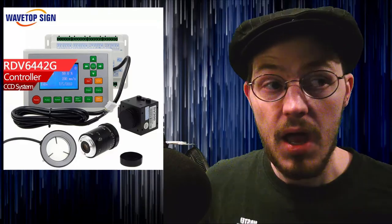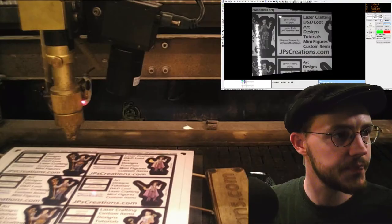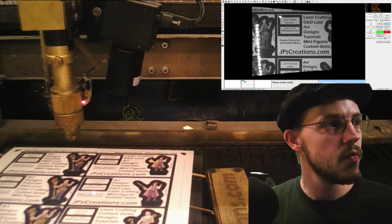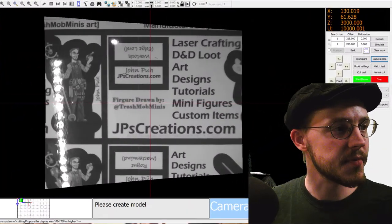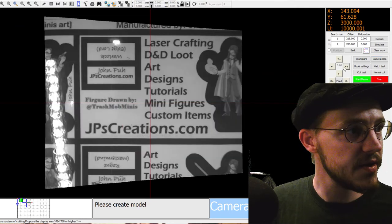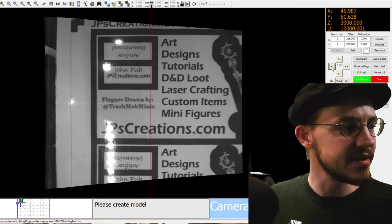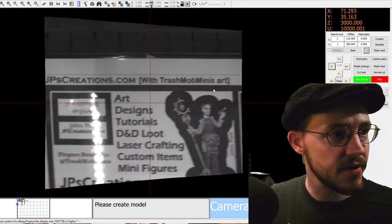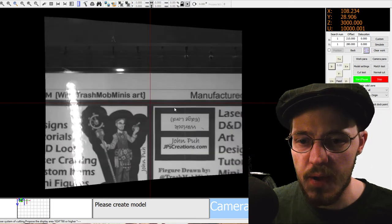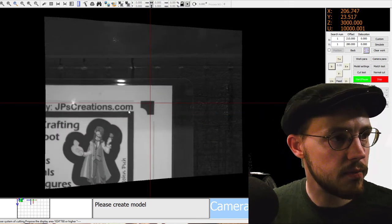There we go. There's a lot of lights inside it already. Here's what it looks like inside the laser, and here's what it looks like with the laser camera. So this is what the laser actually sees, and the coolest thing about this is I can see where I'm actively pointing the laser head, and by right-clicking in this camera space I'm able to move the laser head.